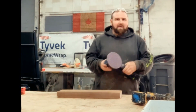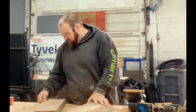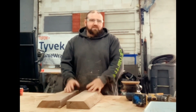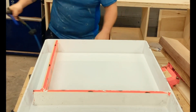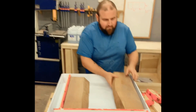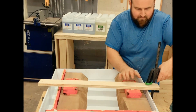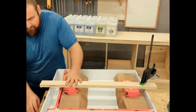We're going to hit both faces — front and back — just to clean them up a bit. All cleaned up! Now we've got to wait on that mold. If I was doing a lot of sanding I would hook this up to my vacuum, but just scuffing them up it would have taken longer to set up the vacuum than to just sand them. Next day, we can get in with our air compressor and blow out all the dust and sawdust, then place our clean pieces in. I've got the whole mold up on 2x4 blocks so I can fit my clamps underneath, and I'm taking chunks of wood wrapped in Tyvek tape with a scrap piece to clamp the whole thing down. It's definitely worth taping these blocks so any overpour won't stick to them — this way they just pop off with a hammer.